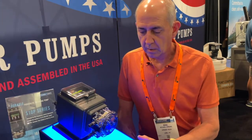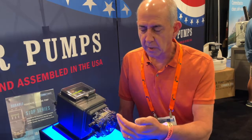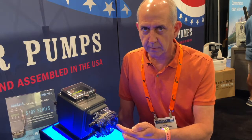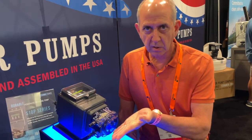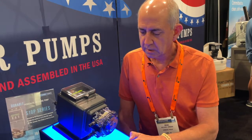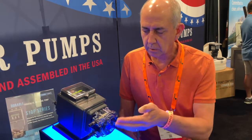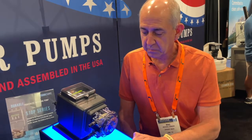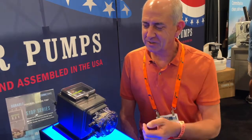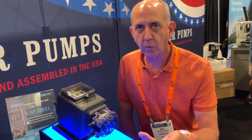Let's simulate a water situation with running water. This is what makes this pump unique with the DC motor — we can drive the roller assembly like this when it receives a signal. This is actually someone using more water. See, it'll ramp up. And then — someone flushed. There it is. It's picking up. As the water runs, this pump is compensating for that water flow.